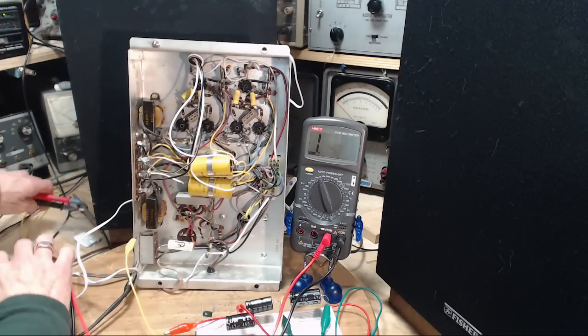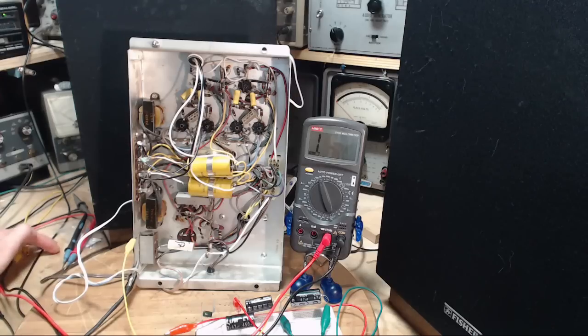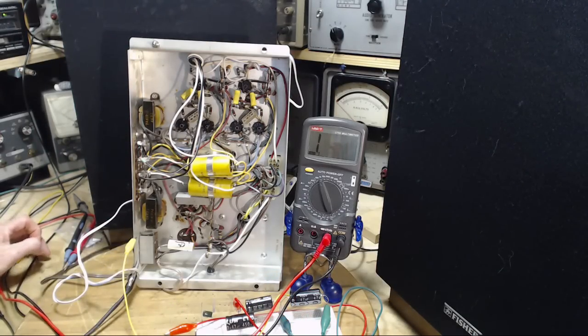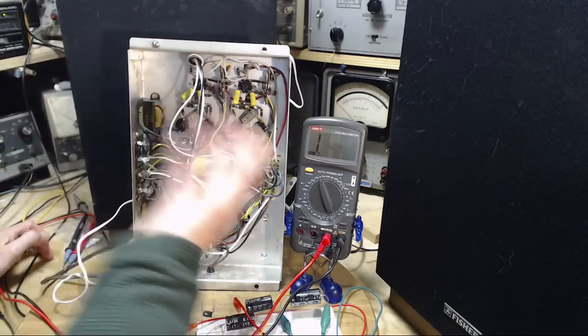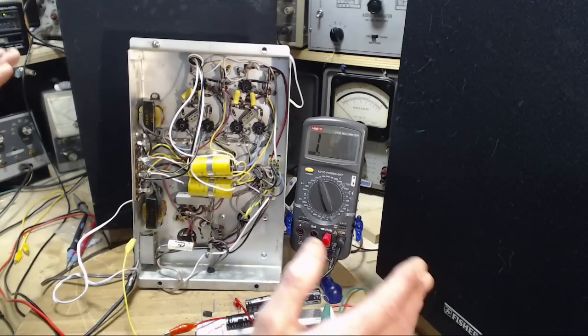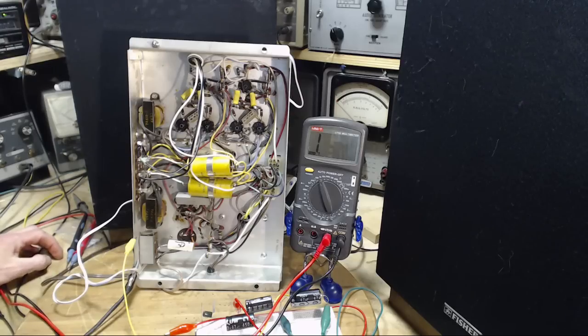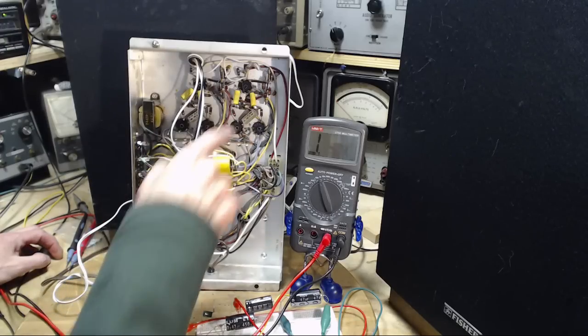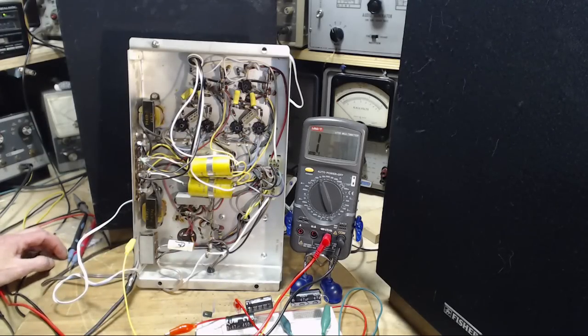So these are the resistors that are controlling the screen current or affecting the screen current. They're quite small. 100 ohms isn't going to do too much, I don't think. Now, I understand that this amplifier is built on the principles of an ultra-linear amplifier, which has a lot to do with how that screen is controlled in here. And I'm not 100% on this stuff. I'm not 100% on anything. So could variations in these resistors bring out a hum? Hard for me to believe that could happen.